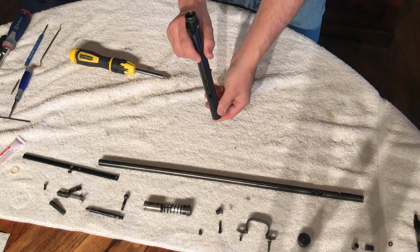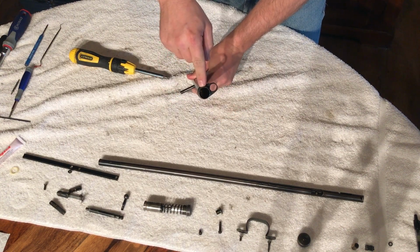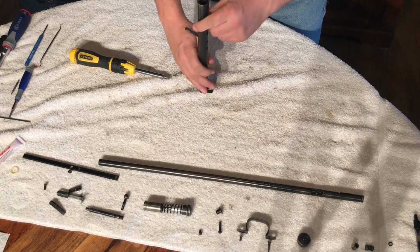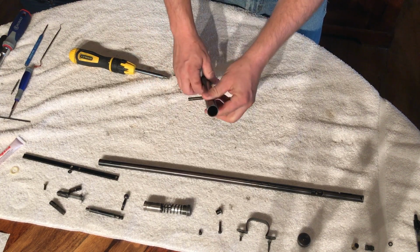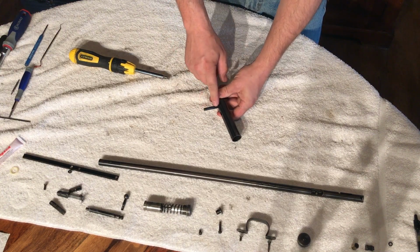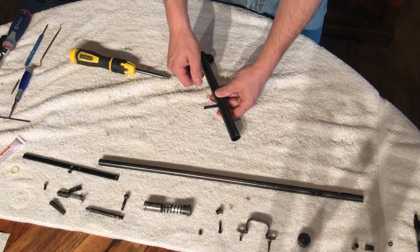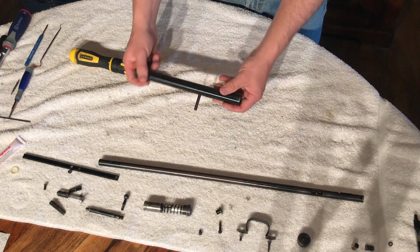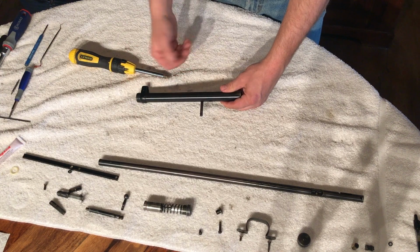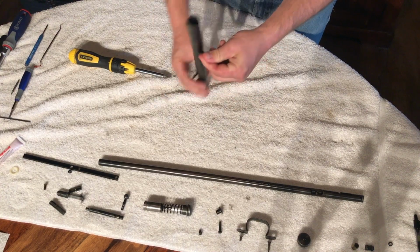The rest of the rifle internals is all here. You can see the power plant in there, the valve assembly, that is. Now this stud right here, you can unscrew this and it's like a donut shaped piece in there. One way to do that is to go to a vise, get a towel or a couple pieces of leather and clamp this in that, and then turn the whole assembly.